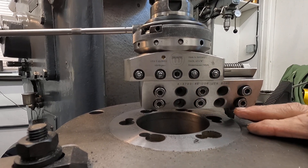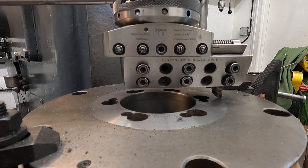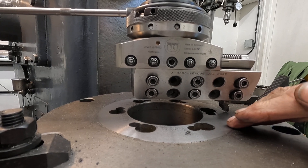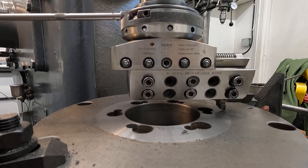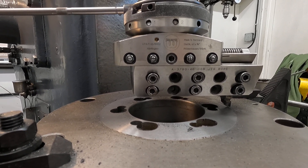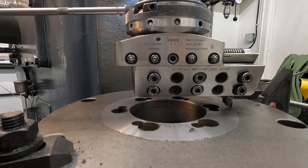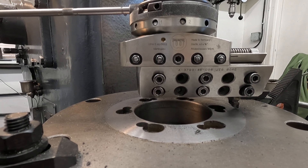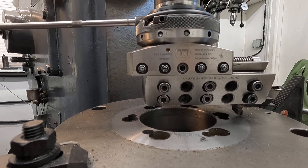The lathe works like this too. On lathes like the Monarch 10EE, they all cut a slight concave and they have to — it's important for lapping things in. You can actually specify how much concave on a Monarch 10EE and it probably costs $10,000 for them to meet that specification. This lathe behind me here has that specification — it was ordered by Western Electric for missile guidance systems. I just thought I'd point that out about how these work.